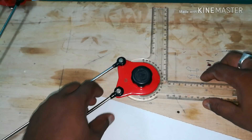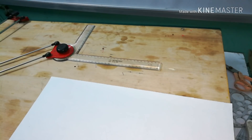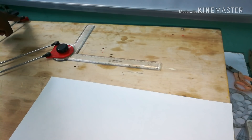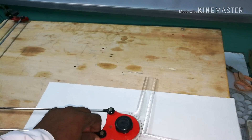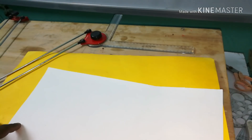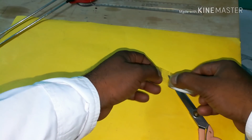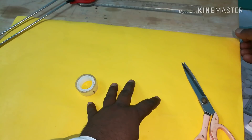Now let us use the mini drafter. The clamp is placed at the top left corner of the drawing board, and at the lower right end I am going to fix the drawing sheet. Before placing the drawing sheet, use a packing sheet to support it so the board surface does not disturb the drawing sheet. The packing sheet is basically a chart of any color, fixed with cello tape over all four corners of the drawing board.